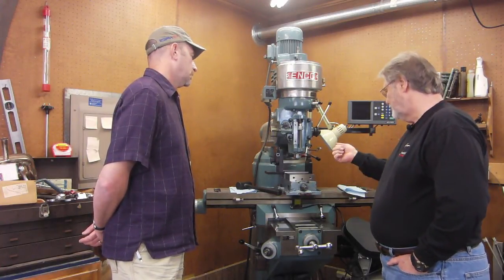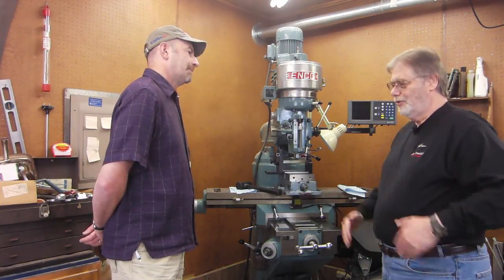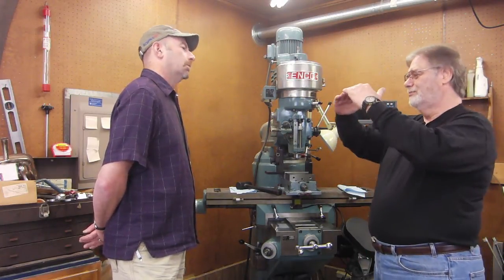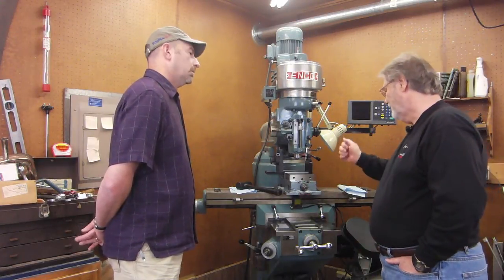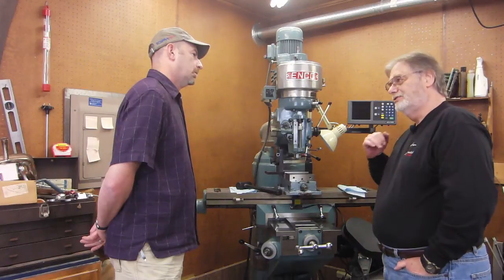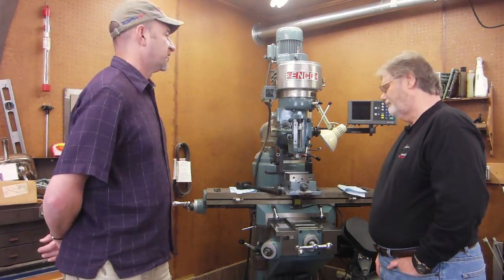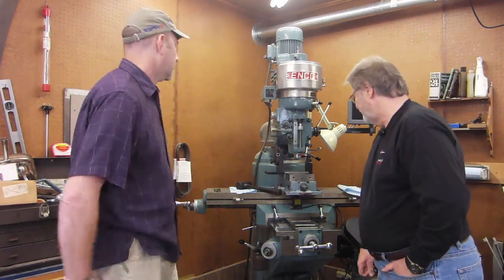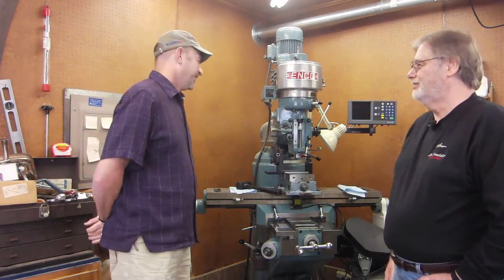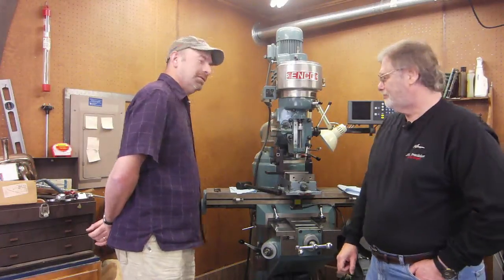Right. This thing, because it was an early Springfield frame, you know that they aren't round. They're pretty much flat. Right. And that wouldn't work real well in this, so I had to clean that up. Just about every frame has runout in it, though, and they're all different. Okay. And so each setup is distinct. It's not just, this is the way I throw a 1911 frame in there. No, it's not like you push the button and go have lunch. Oh, see, that's kind of the way I wanted it to be anyway.